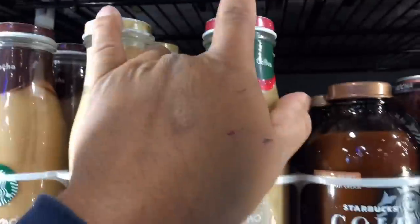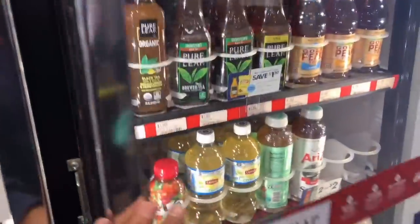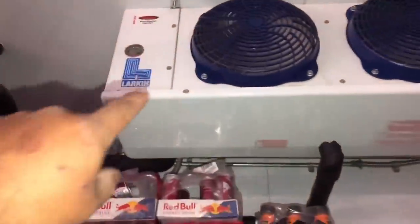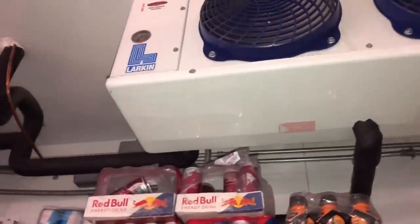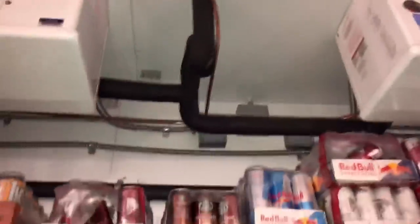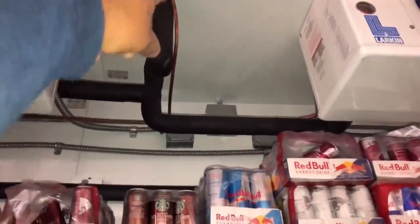Fans are running. Everything is cool, but not cold. All of the evaporator fans are running, but all these are hissing right now — that probably indicates a low charge. I think we're going to have two condensing units, so that's a suction and liquid line.